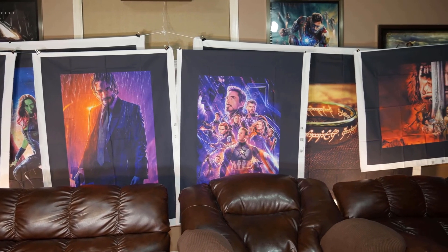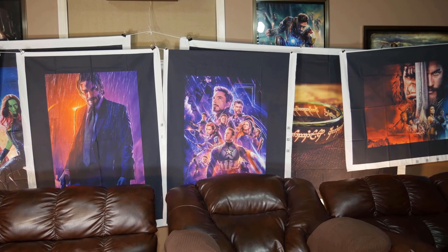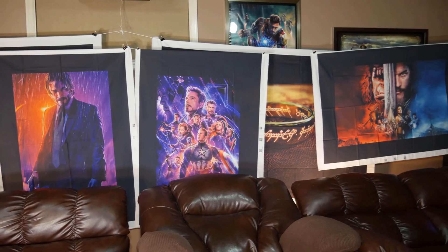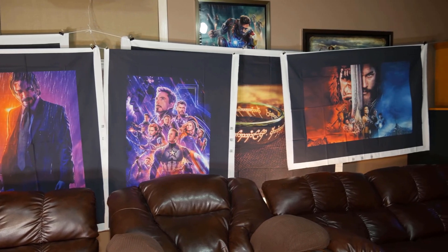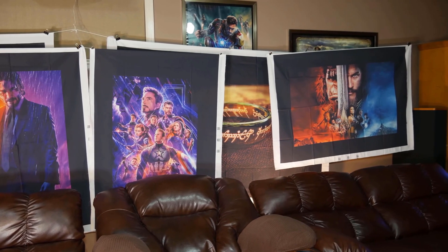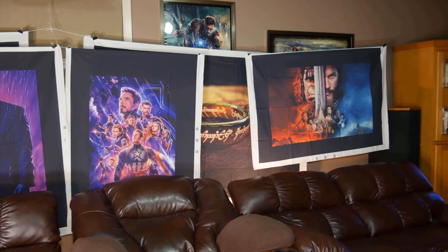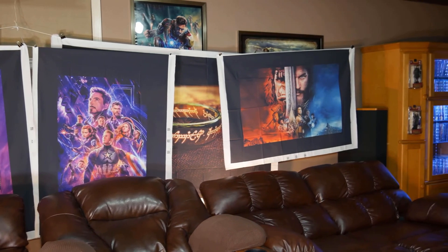I went down and turned it back on. This time we continued watching the movie without the portable AC, and it sounded really good — just the way it always had. So long story short, if you're hitting the limit of 15 amps, your sound is definitely going to degrade. In my honest opinion, having a dedicated 20 amp service is the only way to go if you have multiple amplifiers and a lot going on in your home theater.